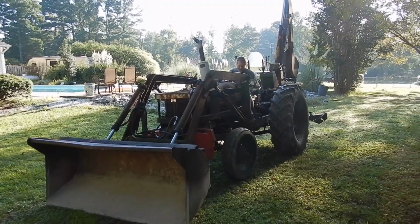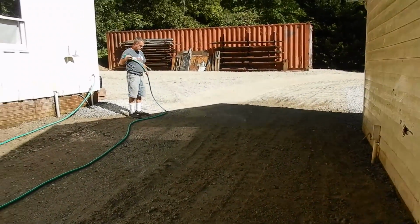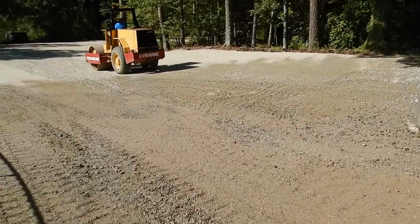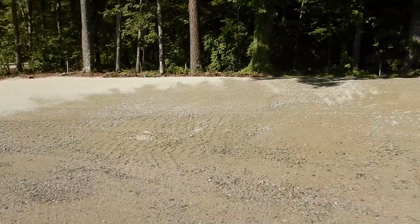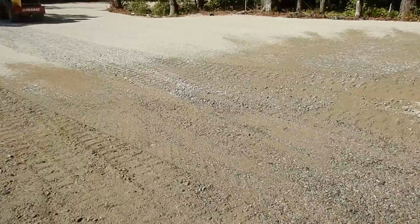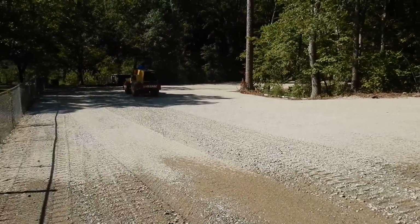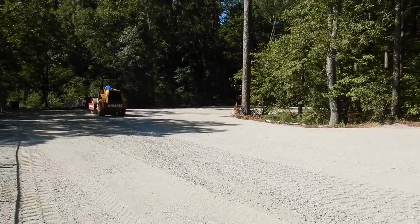We made it. Yeah, you can spray all that too. You were kind of wetting everything down so that it packs pretty good. Up here on the slopes, kind of where the water runs, over here it'll be fine. It shouldn't go anywhere, but right here, kind of where the channel is between the house and the shop, the water's going to run, and if it isn't wet down and packed pretty good, it could possibly wash some. So there's not enough runoff over here to justify trying to wet down another half an acre, it seems like.